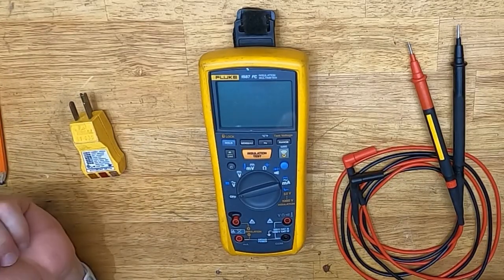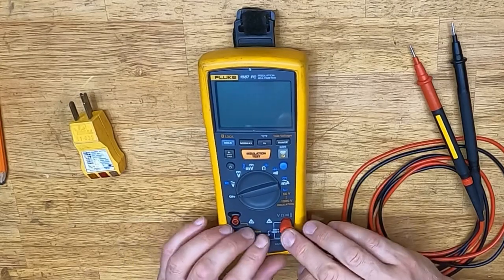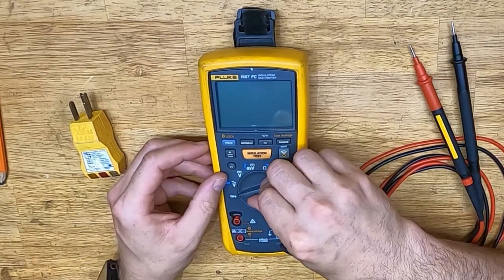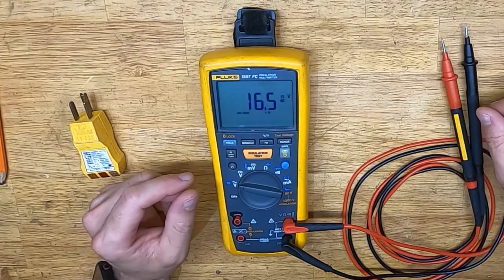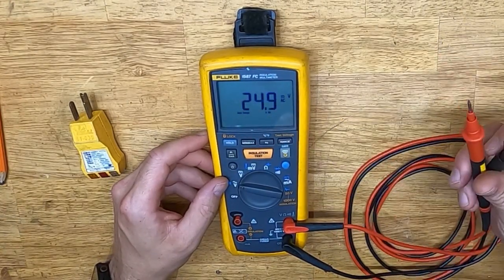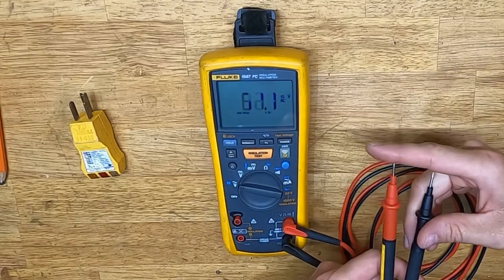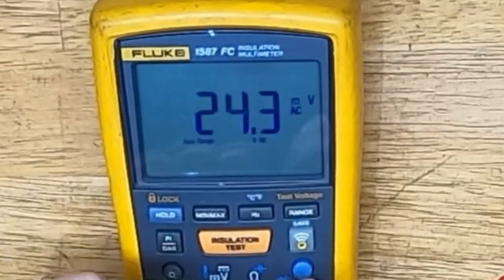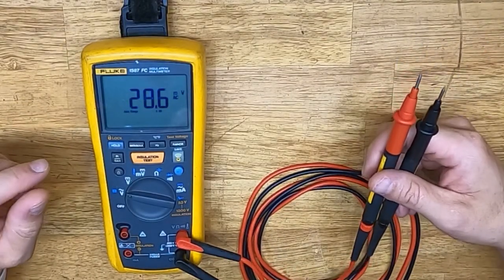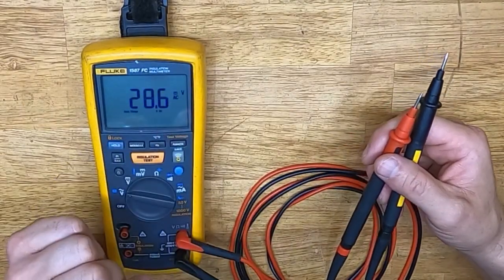Very simply, the leads are usually color coded. You can see this one's red, so you put the red lead in. This one has some extra functions we're not going to get into, but you put the red in the red one and the black in the black one. Then just turn your meter on. Something very important to look for is the correct measurement. You can see right here with the leads just up in the air, we have 30 volts, 37 volts. If I touch myself and go across my fingers - we have 375 volts. No, it's millivolts. So it's measuring some ghost voltage or ambient stuff that's in the air. It's not real voltage because if you touch the two leads together it pretty much goes away. You've got to look - there's that little M for millivolts. That's thousandths of a volt.